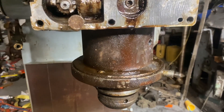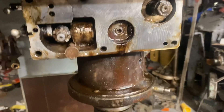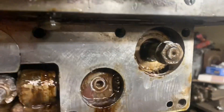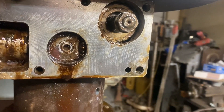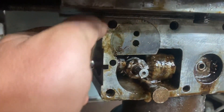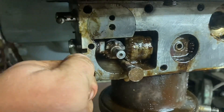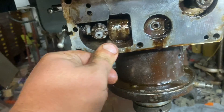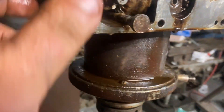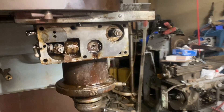This thing is so tight, and you only have a little bit of a handle there. I need to clean this up. I got the plugs out. I'm going to spray a bunch of degreaser in there overnight and let it sit. I put the nut on there, and with a wrench — not hanging on it or anything, just pulling on it and tapping — the quill did go up. So that's all working. And in the middle of cleaning all this, this is moving much more than it was. This is the shifter for the high-low, as it were. That knob is moving a lot freer. So I'm going to let it sit with the degreaser for a day or so and get it all cleaned out.